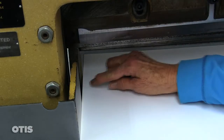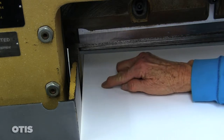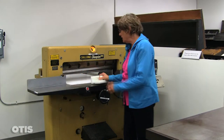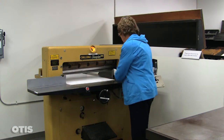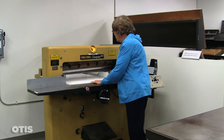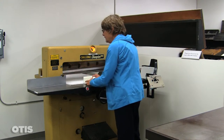The crop mark is now lined up with the outside — that means the edge of the light closest to me. In preparation for cutting the paper, we have a jogger which you can butt up against the paper on either side. That ensures the paper is in here square — square to the left-hand edge and the back gauge.